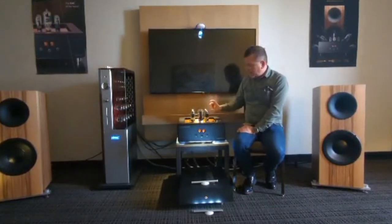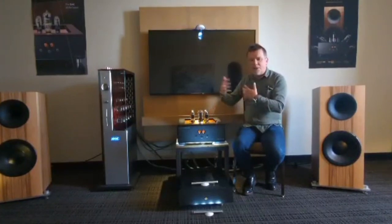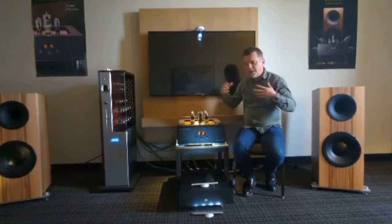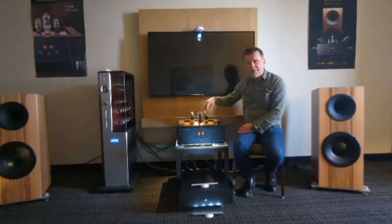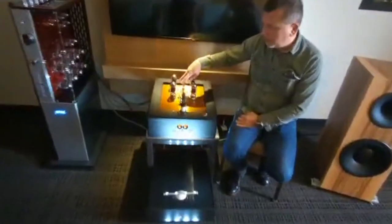We needed big size of tube, because the size of anode dictates a low density of electron stream, and that gives a very easy flowing and very natural sound. And we needed high current and low output impedance, and we achieved all these goals using the pentodes. But then, what are these two double triodes doing there? So you see 4 pentodes and 2 double triodes.